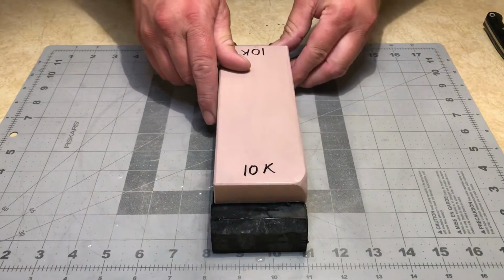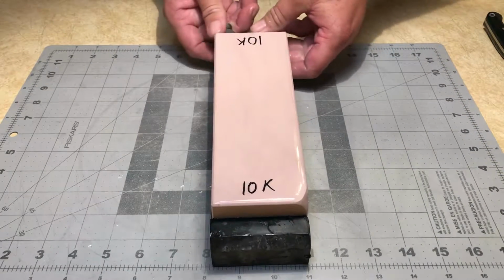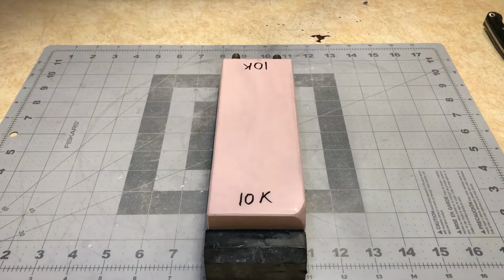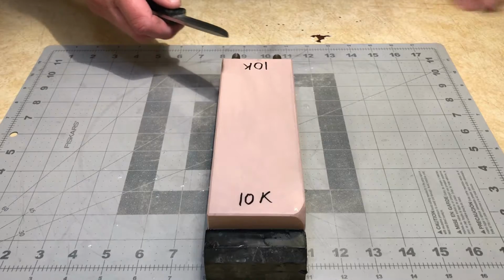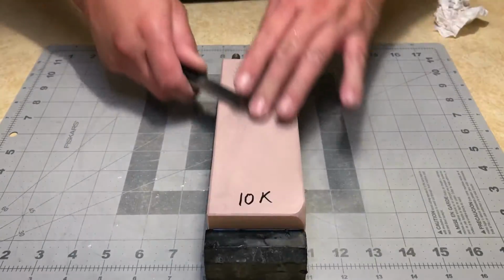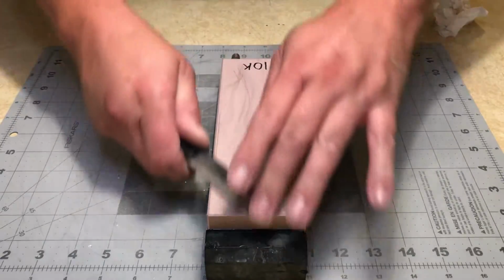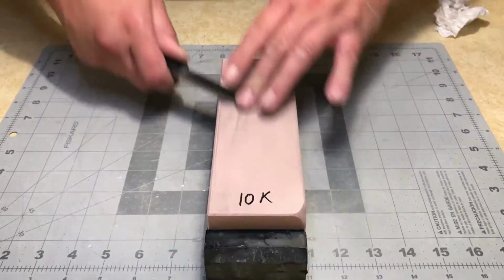My final stone tonight is going to be my Pride Abrasive 10K, and I chose this stone for two reasons. One, it's really hard, and two, because it does a pretty nice job polishing, and I want to get this nice and bright. So I'm just going to start out doing some single strokes, some different angled single strokes here. I'm going to start out pretty much flat on the stone, and I'll slowly raise it